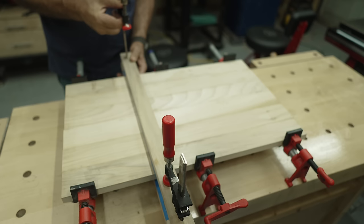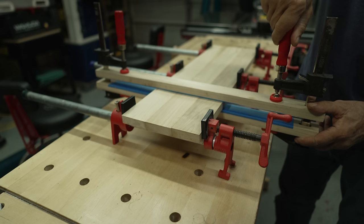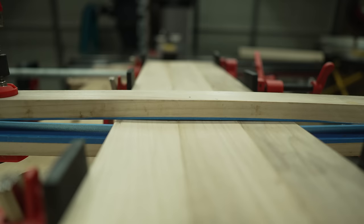These are definitely easier to handle — the clamps won't get squirrely on you. But this solution is far from perfect. For one thing, you don't have any flexibility as to where to place the clamping force; it's always going to be at the ends. Ideally, you want the clamping force applied as close to the panel as possible, especially with wooden cauls — otherwise they can flex or even break.